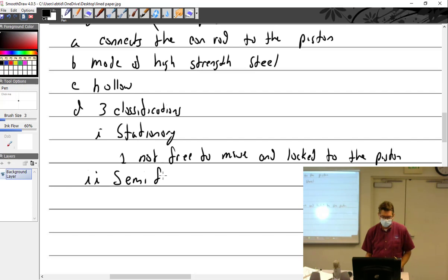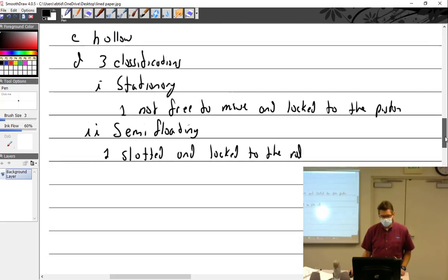Semi-floating. They are slotted. Slotted and locked to the rod. I am not familiar of any aviation connecting rod or piston pins that are like that. Again, doesn't mean they're not there. Just means I'm not. Ooh, wait a minute. I want to say I worked on one engine that had something like that, but I don't remember it anymore, so it doesn't count. And then there's full floating,